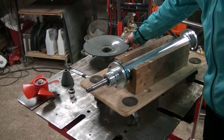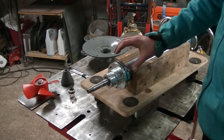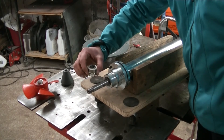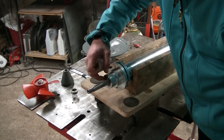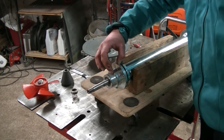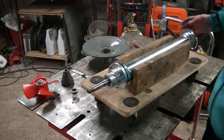Now I have removed the upper turbine housing and this is the core. The complete core is still functional. With the old type water-greased bearing you cannot turn this, but here you can see the carbon seal — this is the rotating part and this is the steady part. Above the seal are the actual bearings: two roller bearings, with the shaft running dry. Here is the sealant between the two flanges, and on the other side is a roller bearing to hold it steady.